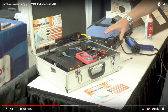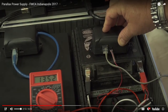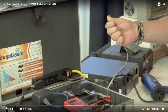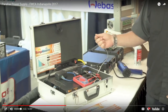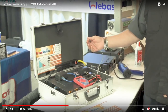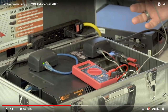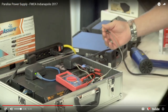Where you're at your battery, you attach another module to your battery with a short lead, and it has a thermistor in it that measures the temperature. Do you recommend that be on the positive terminal or negative terminal? Negative terminal. And it needs to go outside to the battery box — it's against code to put an electronic device, a spark producer, inside. So you run it outside the battery box, up into your cabinet, or to your compartment next door. Pretty simple installation, and it takes it down to about 20 minutes.